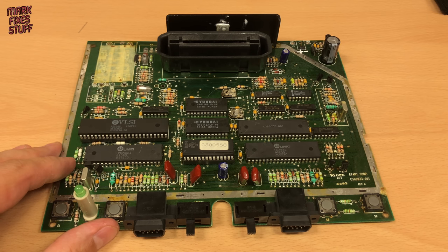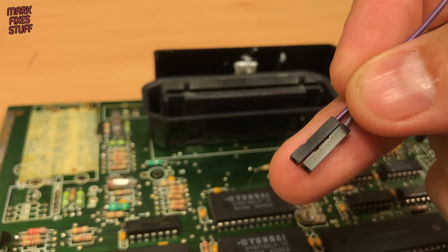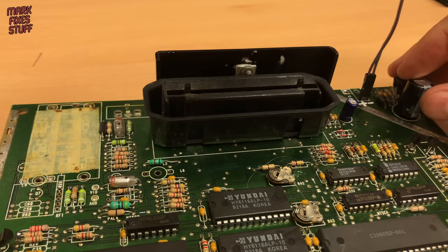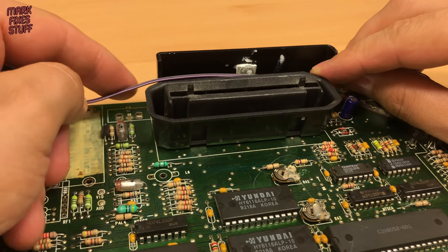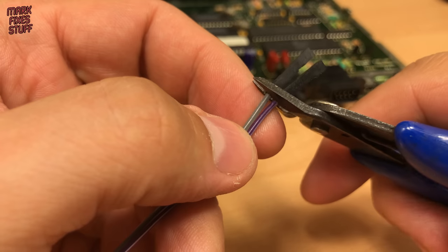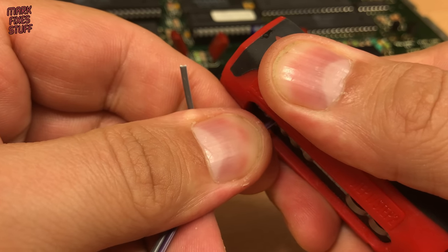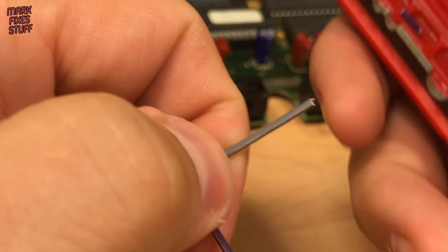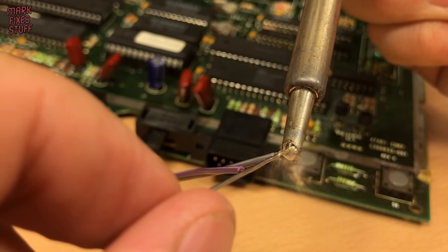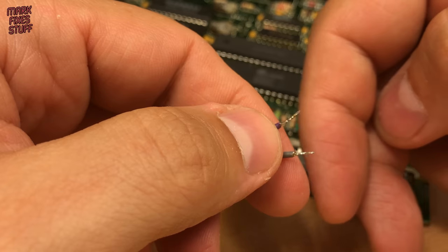Now the board is recapped — let's make up the power cable. I'm going to use this DuPont wire because it's already furnished with handy connectors for our power header. But stripping the wire, I start to get a bit nervous. This type of wire really doesn't solder very well, never mind how much flux you use. Although the dull finish of the tinned wire is not encouraging, let's just solder it on then.